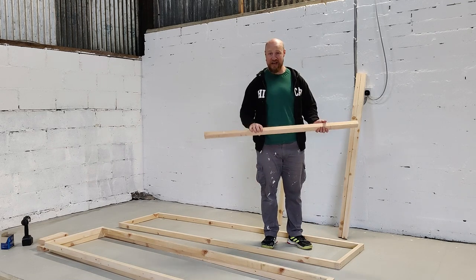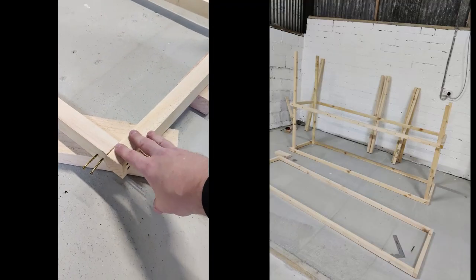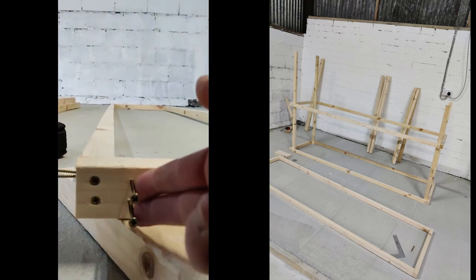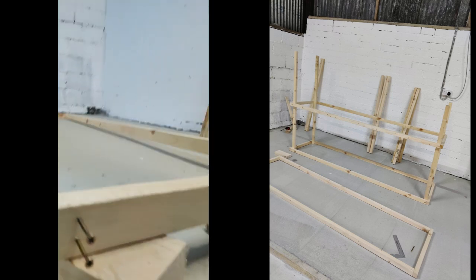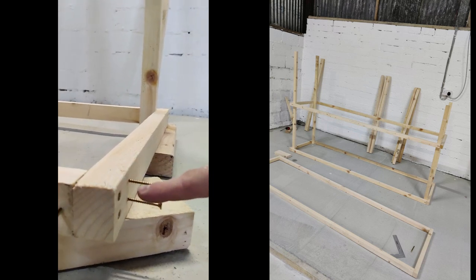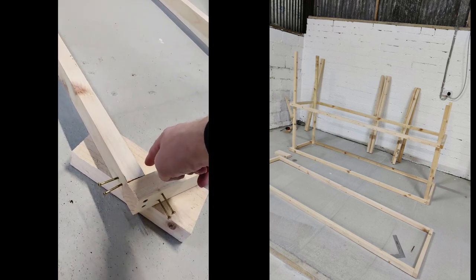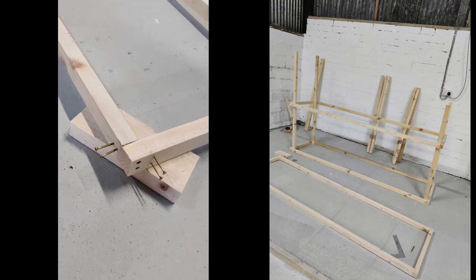These aren't exactly 48 inches, they're a little bit more than that. You've got a lot of screws in this area to stabilise the uprights. These 2 screws and these 2 are in the same line, then these 2 screws are going in the centre. I want to avoid these screws hitting off each other or stopping them going in all together.